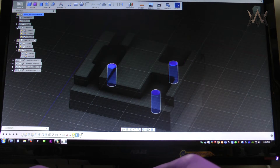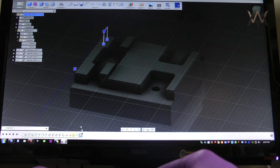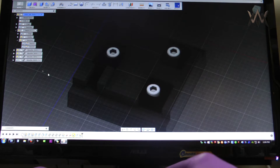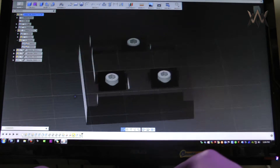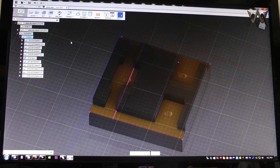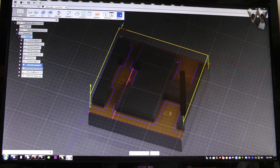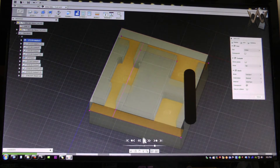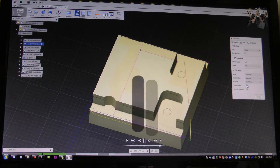Here in Fusion, this is kind of what my design for a 1x fixture is going to look like. I don't want to make a whole huge fixture yet until I know it's going to work. What I'm going to try to use are these Mighty Bite Pit Bull clamps. The main reason is to eliminate all the stock prep, but it will also allow me to combine the drilling and reaming operations of the main bore with the profiling operations, adding more consistency and eliminating a whole other setup.